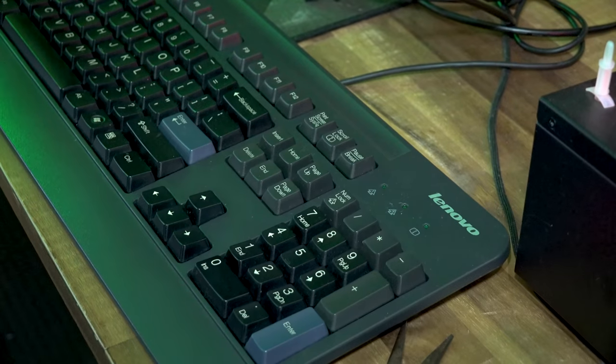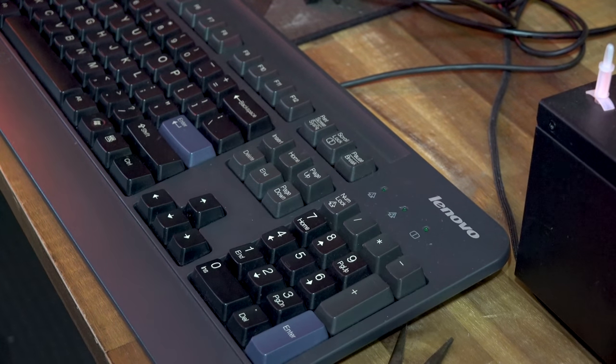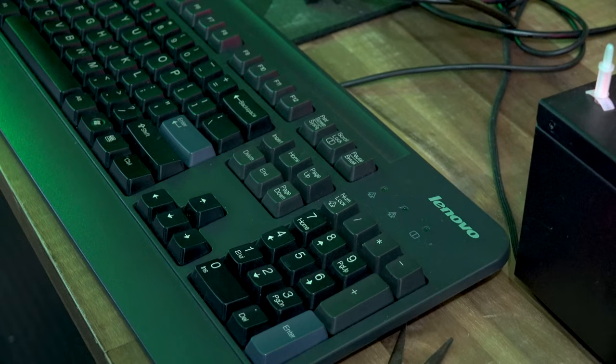Now, one thing when you're testing motherboards, you can go through them pretty quickly like I do here, if you've just got a basic stick of memory and also just a basic graphics card. This here is like a 5670 and I just plow through them. And so the signs that you're looking for are basically, hopefully, a keyboard post in that you at least get some kind of a light out of it.